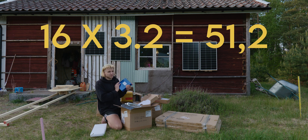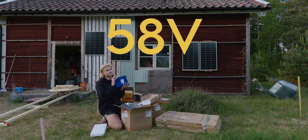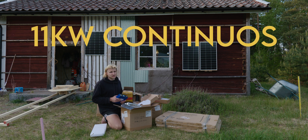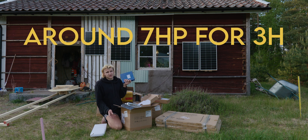So 16 of these makes a 48 volt system. When fully charged it will be 58 volts. It should have a total capacity to drive the electric motor with about 11 kilowatts — 11,000 watts. They can discharge quicker for a short time, so it should be equivalent to a 15 to 20 horsepower motor.